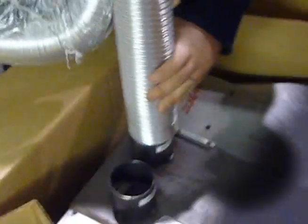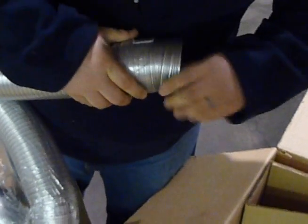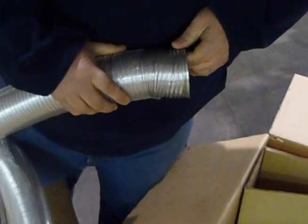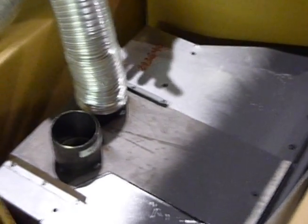On the compressed flex, the smaller box — you'll see that while it's all compressed and shrunk down, it doesn't want to fit on. But as soon as you open it up and pull it out a little bit — just like normally an installer would have one guy at each end to stretch it out, because otherwise you don't think it's very long — if you open up the flex, now it magically fits down on.